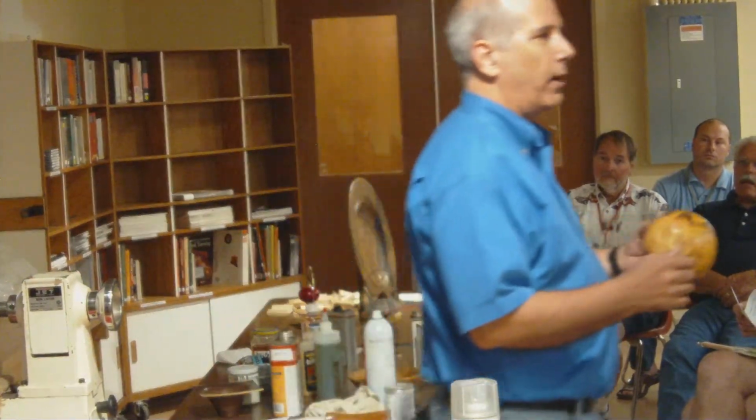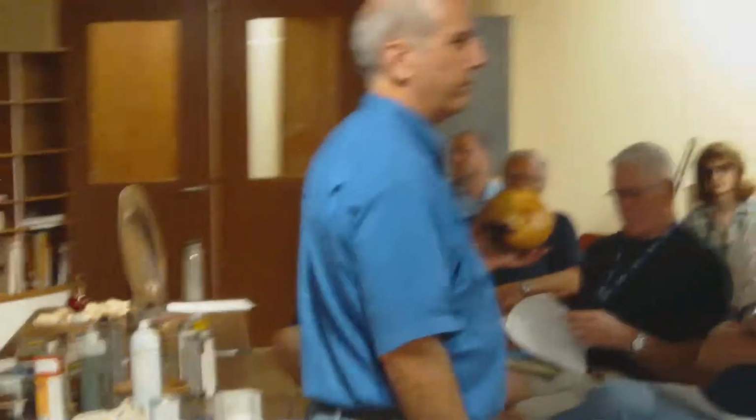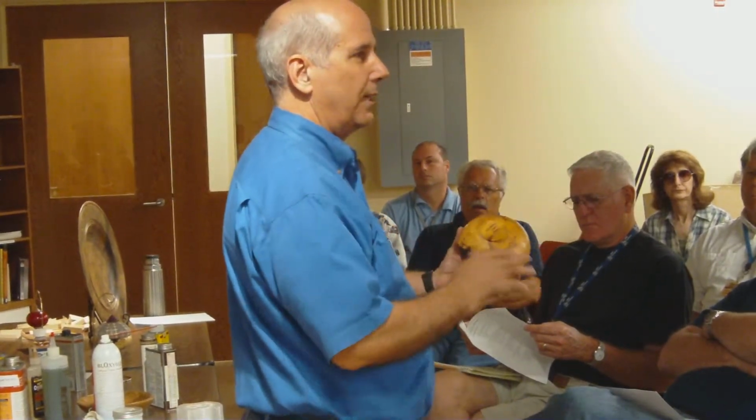Slow cure, no cure. I forget what it was, but this was not curing in large areas. I actually put a couple of drips of Japan dryer, which is a catalyst, and wiped it off. For a spray, it's way more than we need. Usually you just put a few drops of something to hasten the cure with the Japan dryer. I just put it on there, and overnight it was solid. I put my next layer on, no problem.